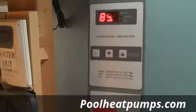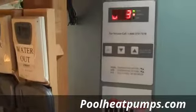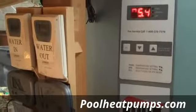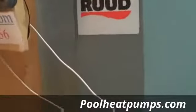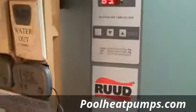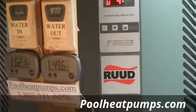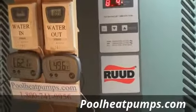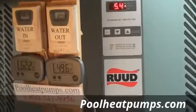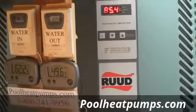The primary purpose of the cooling mode is to keep the pool nice and cool in the summertime, where my pool will get up into the upper 90s on its own with no solar blanket when it's 115 degrees every day out here. Another great feature: this heat pump is AHRI certified, meaning an outside laboratory independently verifies its results to be accurate based on the manufacturer's specifications — which for this model is a 5.7 COP at 104,000 BTUs. That's a very high-efficiency model compared to most on the market, and it's definitely working as advertised.